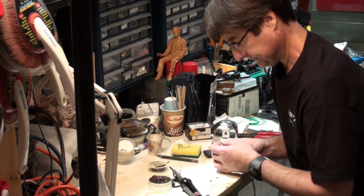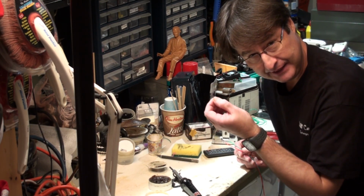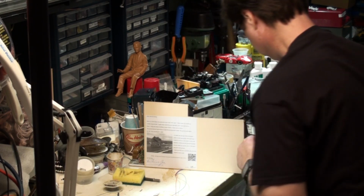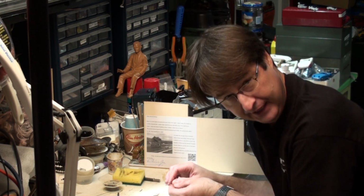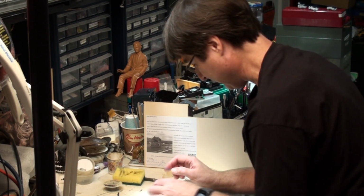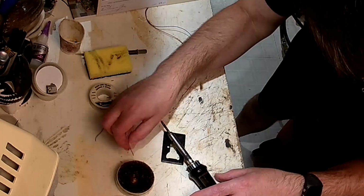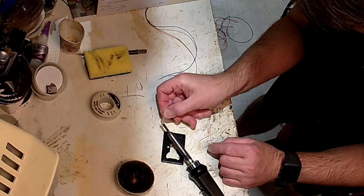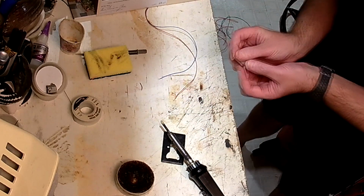Okay, so we're going to be really careful. Bring over the piece of scenery and solder over the plug to the scenery. As you can see, we're going to be really, really careful. I took a look, and Frank-Peter, you're amazing, because he gave wires that were already tinned, so they're ready for soldering. So let's just tin these wires then, as we should. Let's tin both of them. A little bit of solder on our tip there, and there we go. 2 nicely tinned wires.